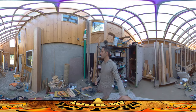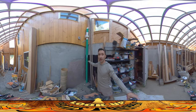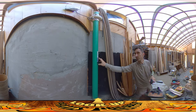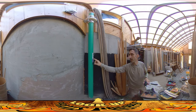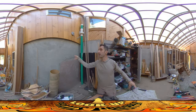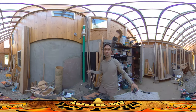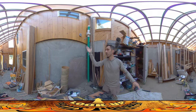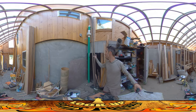Before we leave here, I want to talk about a couple of things. One, the radon vent here has been working great. You can see the pressure differential between atmospheric pressure and the suction in here. There's definitely a suction being created, and since we started using this remediation tool, the radon — which had been not okay in the house — has come down and has been totally fine. So this has been working.